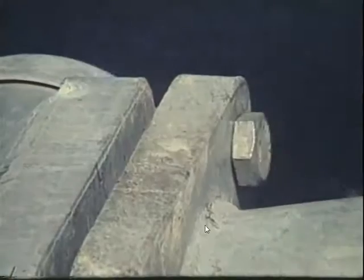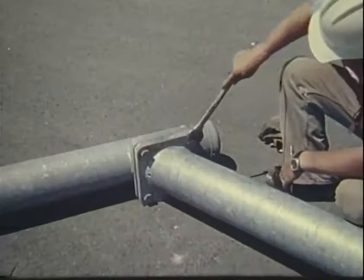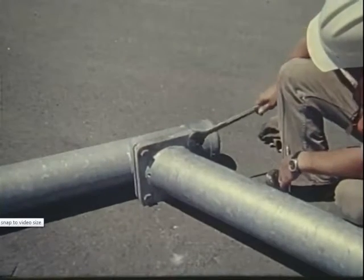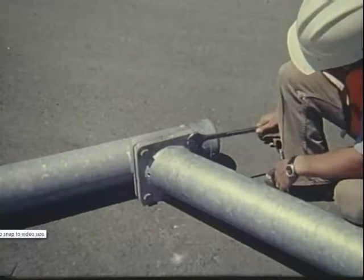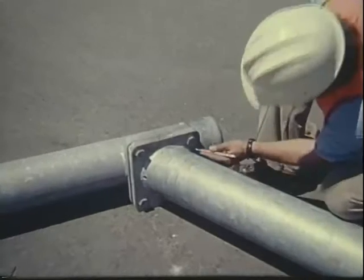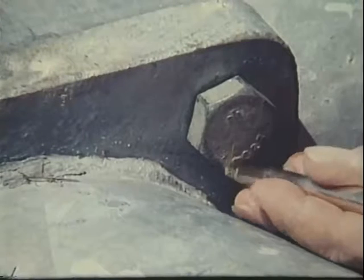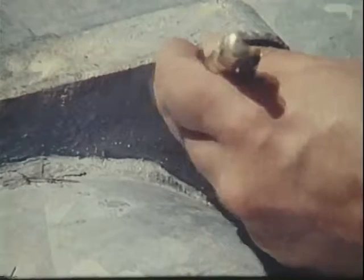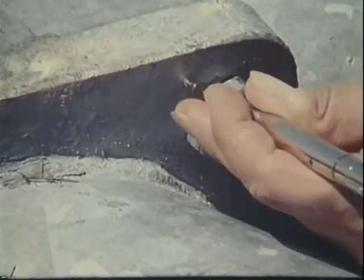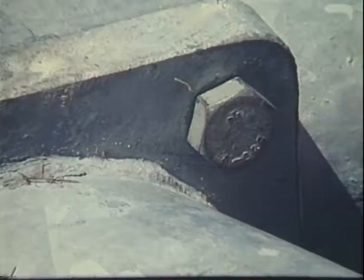It is very important to get the right tension in the cap screws. Wind loads on long mast arms can cause fatigue in the cap screws, and the cap screws are more likely to fail if they aren't tight. Because of the fatigue problem, the specifications for cap screws have been changed. Now you should tighten the screws one-third of a turn past snug tight. Use only new cap screws, which have plenty of dry lubricant on their threads.